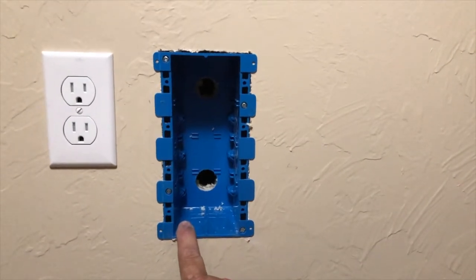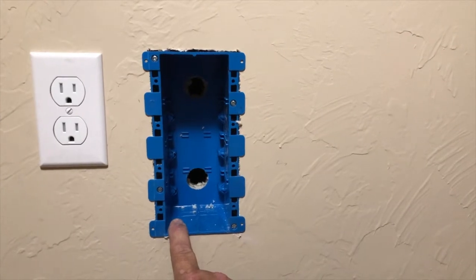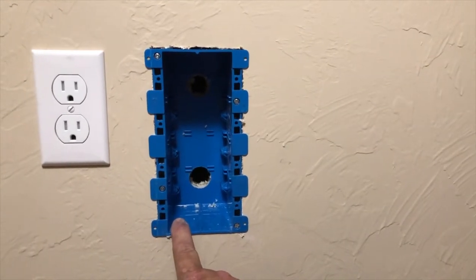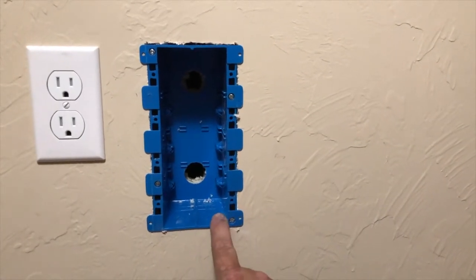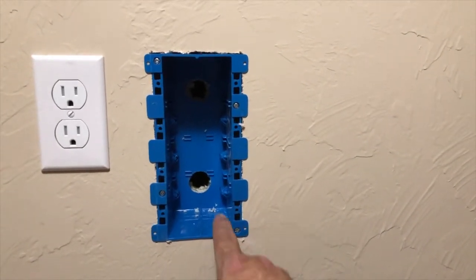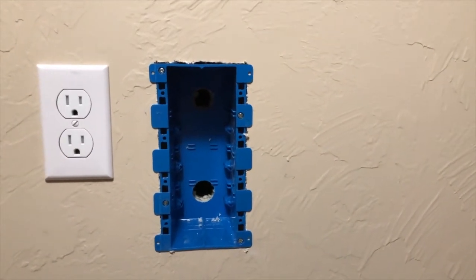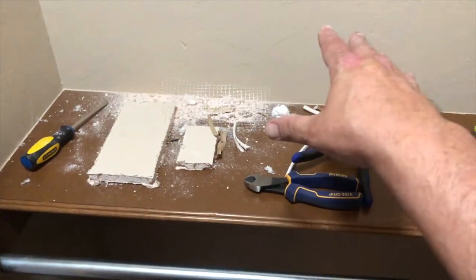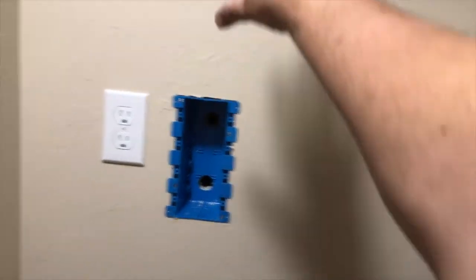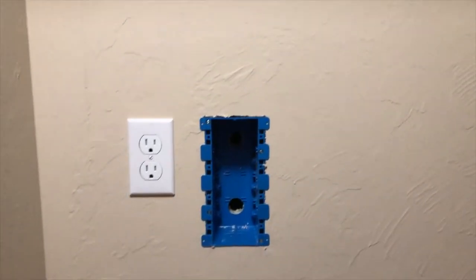So, you know, if we ever decide to move, somebody can increase the cameras if they want. The system comes with 10, so I might as well wire it for 10. And then I'll have four keystones left over for RJ45. One will be my uplink, and then there'll be three wireless access points. And then we'll have the switch sitting here, and the CCTV DVR here, and then right here I'm going to mount, or I might put up here, I'll mount the monitor for the CCTV system.